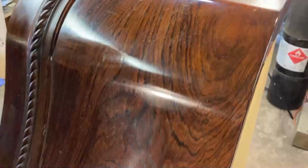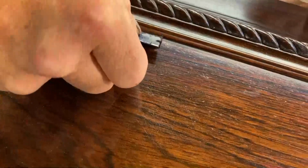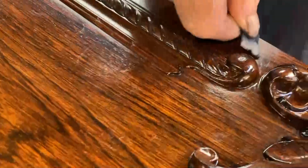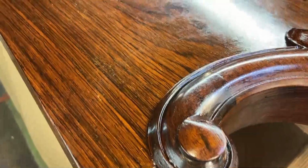Okay, that's it. And I'm going to sand this down again, but with a fine sandpaper, 320 now. Oh, the same hole. Gotta make sure I fill this in there. There we go. This stuff doesn't shrink very much. Oh, we got another little one here, I think. Yeah. If you see them, fill them in. I don't see any more. Okay, that's it.